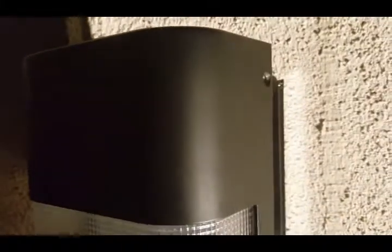One thing I can say is, in my particular situation, the light gets mounted right next to this architectural accent here, and so it makes it absolutely impossible to access the two side screws on the opposite side. So unfortunately, to be able to install this to the wall, I had to leave those two in and bend the light away from the bracket so that I can put the bolts in place, the screws in place, bolts, whatever you want to call them. Now this is where having this kind of screwdriver, if you ever wonder what they're for, well, this is what they're for.